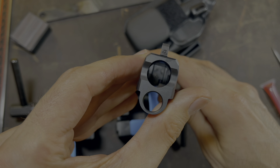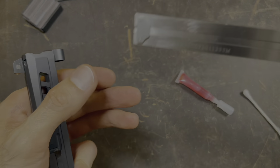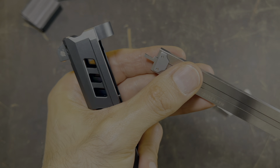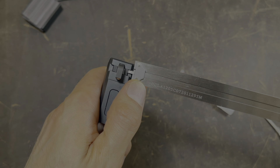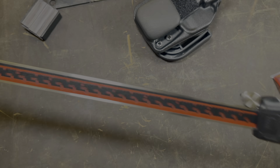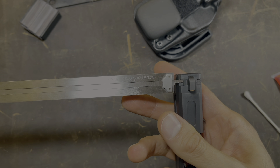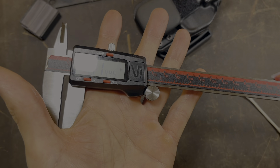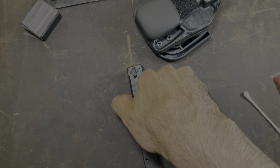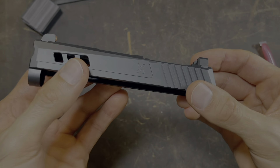Now let's check the centering. With the calipers, I make sure it's zeroed, then go to the other side and make sure the little depth piece sticks out. I check from the top and push it in to make contact with the slide. One, four, three — let's do the other side. One, four, four. That's good for me — we are good to go. So now I'll take it to the range and shoot it to make sure everything's zeroed.